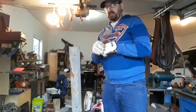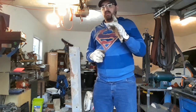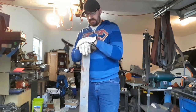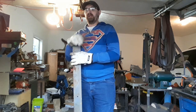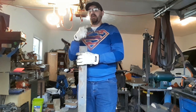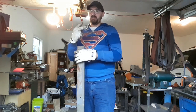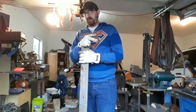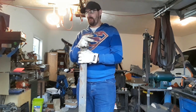So today's project is something I've been going on about for a minute. I'm going to work on making a Damascus hammer billet. The first thing I have to do for this is run this piece of steel through the Chandler Dickinson quality assurance test. I have got to cut a small strip off, heat it up, hammer it down to blade thickness, and then put it in the vise and snap it to see, number one, if it hardens, and B, because I can't say number two with a straight face, see if the grain structure is where I like it off a water quench, because I don't want to oil quench a hammer billet, because all I got right now is a 1 gallon paint bucket full of canola oil, and I don't want that fireball. There's no way to contain that.